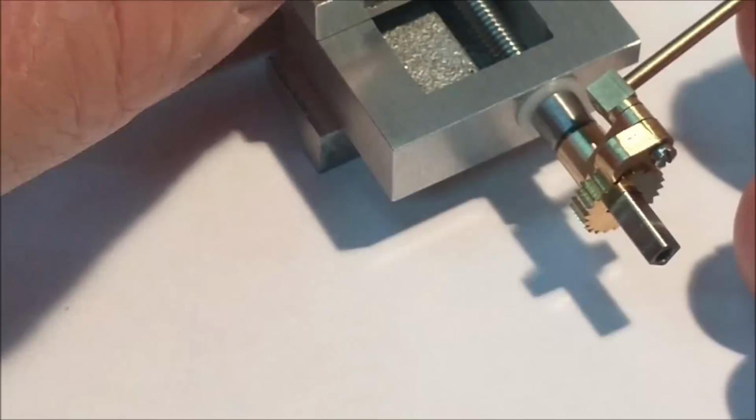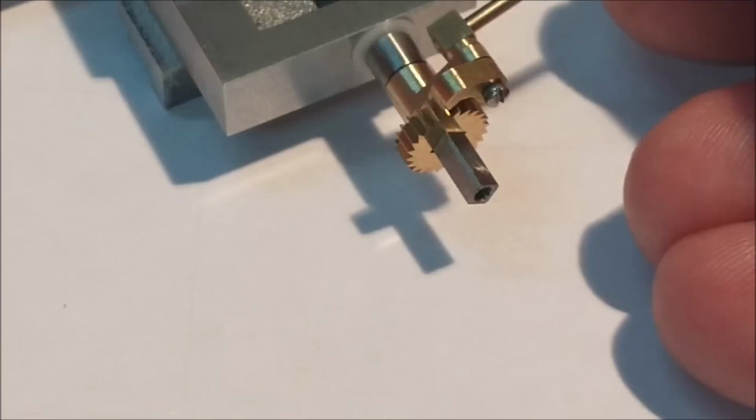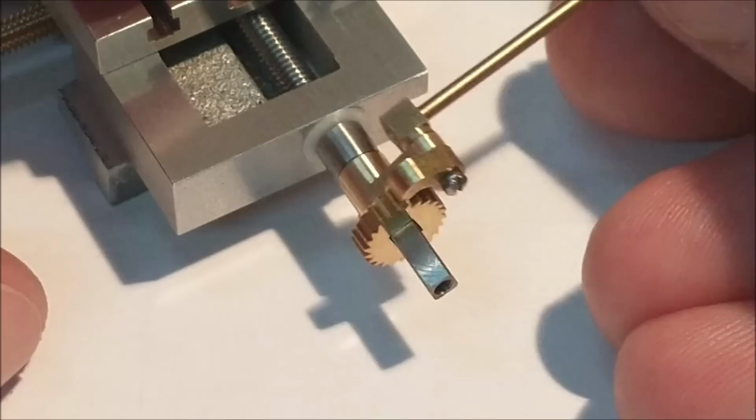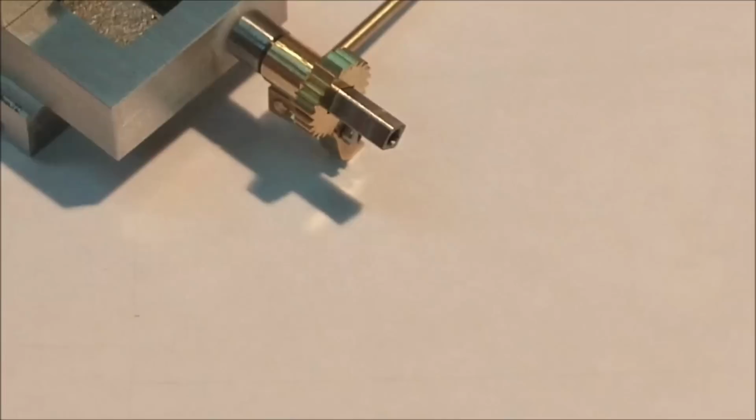All right. Now, as this arm oscillates, this little pawl on the end will climb over those teeth and reset and continue to push. And as it pushes, that motion is actually turning the lead screw. And when the lead screw turns, the table moves one way or the other. So that is the feed mechanism driven by the intermittent movement of the ram. The ram will control that little lever. Should be pretty cool when it's completely done.